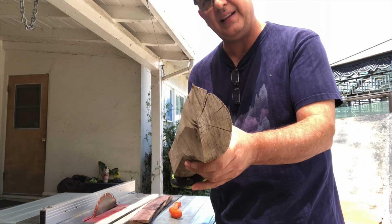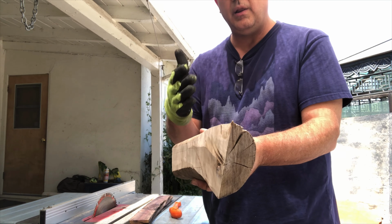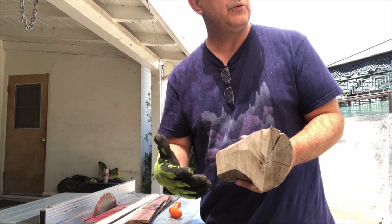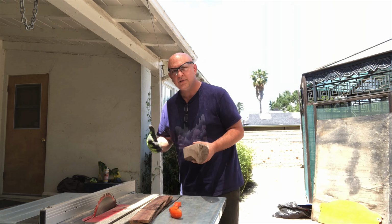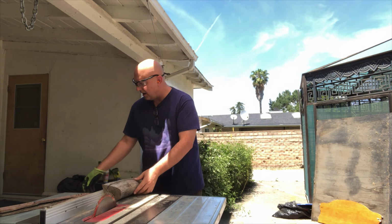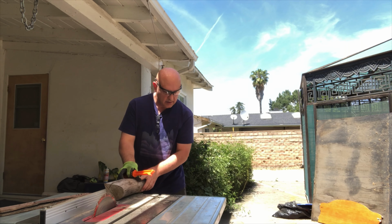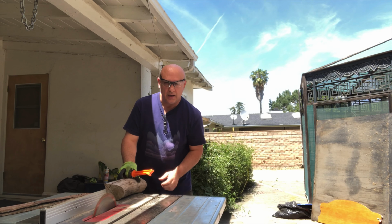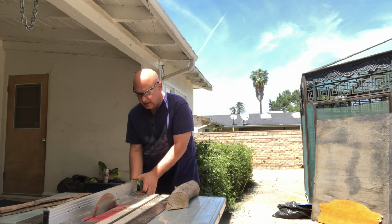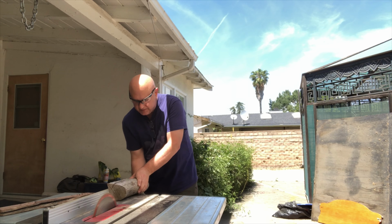So now I'm at the point where this flat side can be thusly measured to 1-inch sizes. So my goal is to have somewhat a uniform thickness to create what will be sand paths through the property. So check this out. You can see me without my head chopped off. So I have this Delta saw, and once I turn it on, I got my earplugs in, got my goggles on, got my push stick. I can set the machine for exactly 1 inch or just enough that I can clean one side. So my goal right now is to clean one side. That's where I've set it.